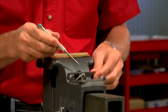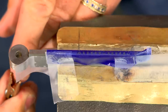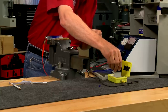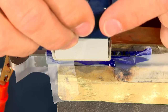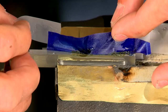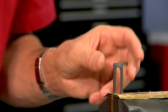The original staff had markings on the side, so I'm going to duplicate them on this sight. I've printed a stencil and with it taped in place, I electrochemically etched the marks onto the staff. With the markings complete, the top corners of the sight are rounded over to match the original.